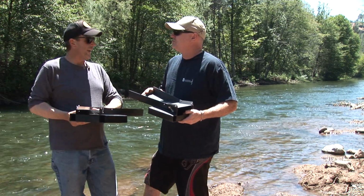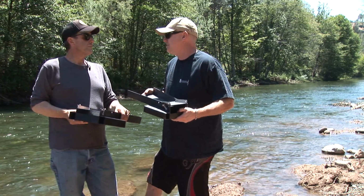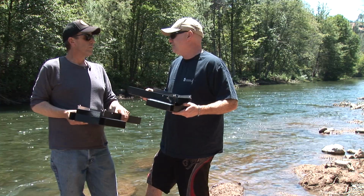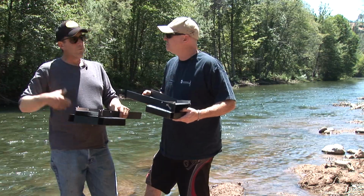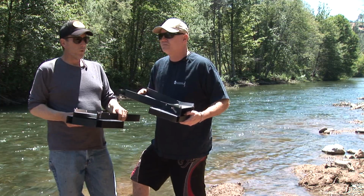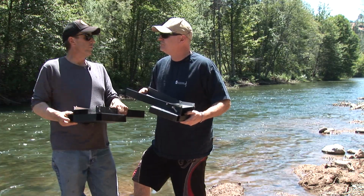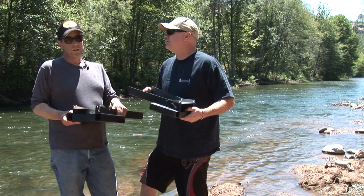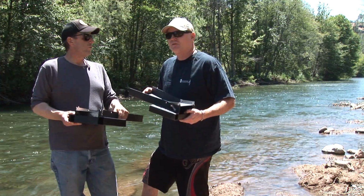It's not that the machine can't handle it, it's just when you have big rocks in here, you're gonna lose gold. So with any fluid bed design, it is always good to use a classifier, but you may save some time by not doing so, but you might also lose some gold basically. Sure, I mean, obviously you can shovel faster than you can classify, but the problem is you're just gonna shovel more dirt. You will not get as much gold as you shovel because the efficiency goes way down. So there's always that adage of shovel more, get more. Okay. But that really doesn't translate. Okay, they're just going to have to decide what they want to do best for their needs. Sure, sure. There's situations for both.